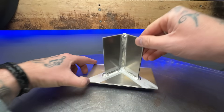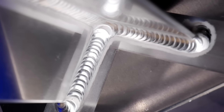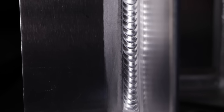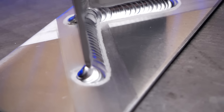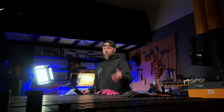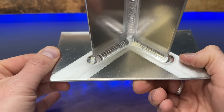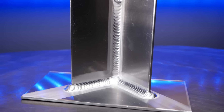That was smooth sailing — let's check it out. Look at the flow of these passes and how they look all together. We don't have any buttons anywhere dumb, no starts wrecking consistency. All passes flow from one side to the other, keeping the same size and shape. Stepping distance all looks similar, consistency looks great, and the wraps on the end close up the open corners really well. Most importantly, look at the pocket: the filler is washed out to all surfaces for really good edges, but not too far out with too much filler — that's how you block penetration. We have no gaps between passes, no voids, no holes, no incomplete fusion. All the problems we focused on earlier are taken care of.